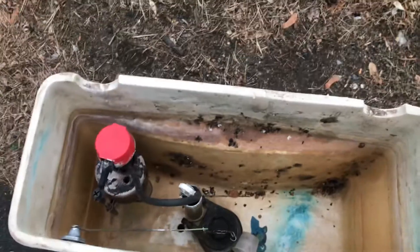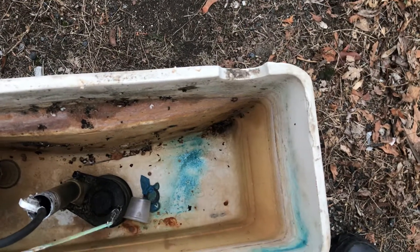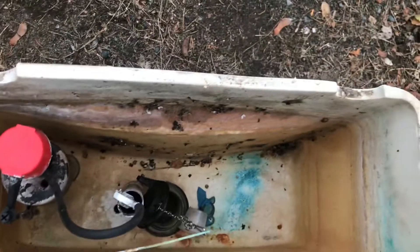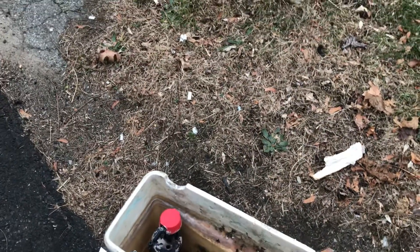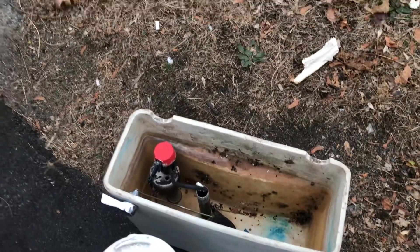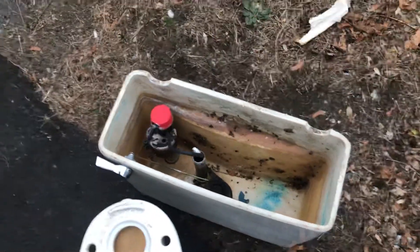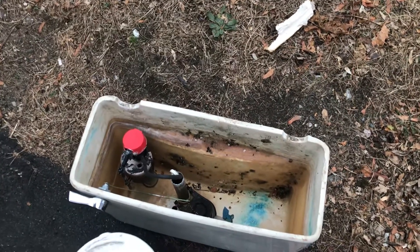Inside the tank is obviously cleaner than the outside of the tank. I believe the only thing original is the flush valve. The flapper, handle, and fill valve are not original and are all coming out to be replaced with something better quality. I have a Fluidmaster 400C combo kit from around 1989 that I will use — the flapper and fill valve from that kit. It's an 89 400C, and the bullseye flapper will come off and fit right on that flush valve.